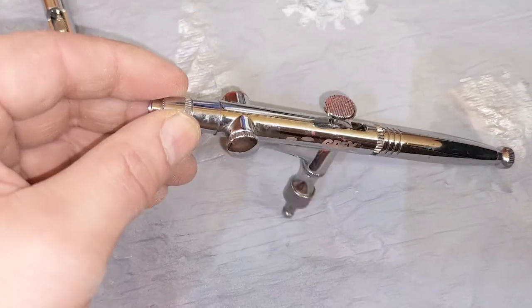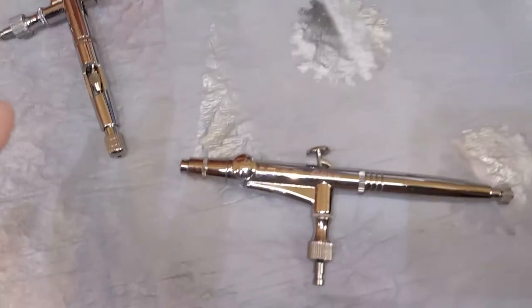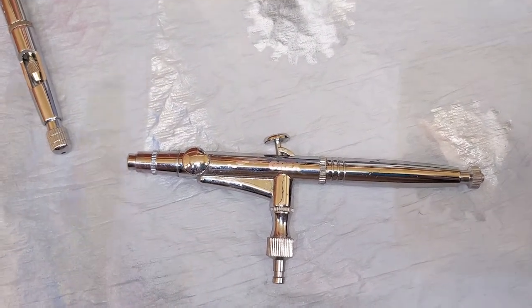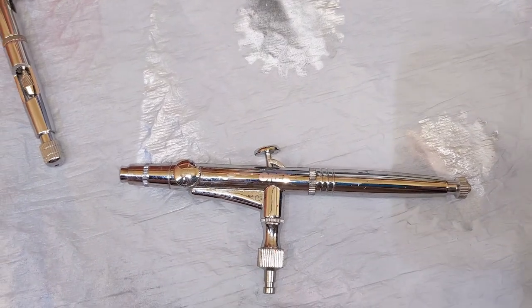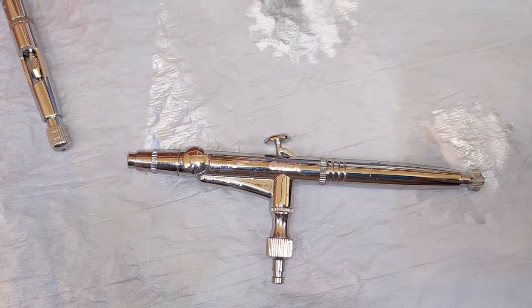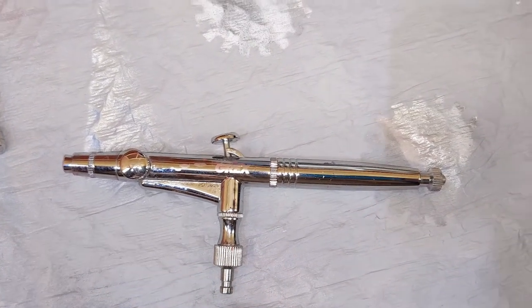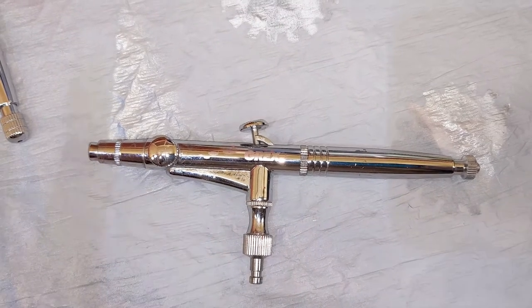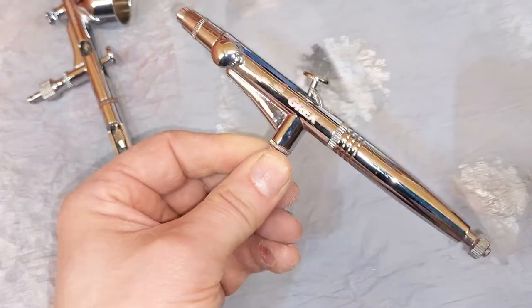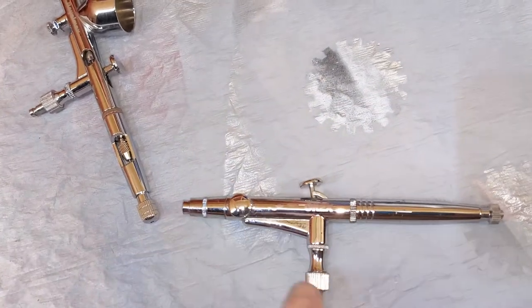The difference is this one's a siphon feed. I don't really like these. The biggest reason why is that if you're painting stuff and you're changing colors often, it is a major pain in the butt to change colors. It takes a long time for you to flush it out and clean it. The nice thing about this one is some of the bottles are huge, so if you're batch painting stuff, you can just keep banging stuff out really fast without changing colors. The really nice thing is it's all PTFE O-rings and seals inside, so you can spray lacquers, enamels, and everything. Again, it's just a pain in the butt to clean, but a really high quality airbrush.